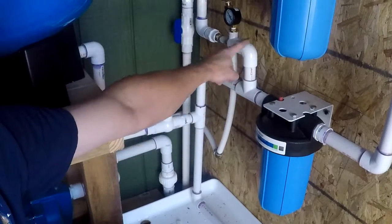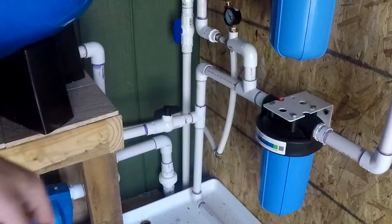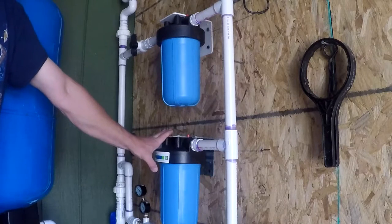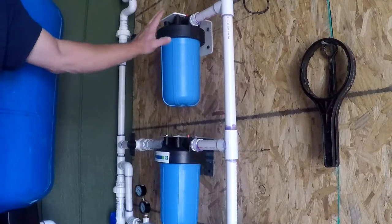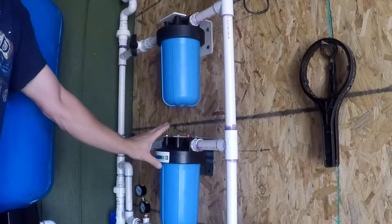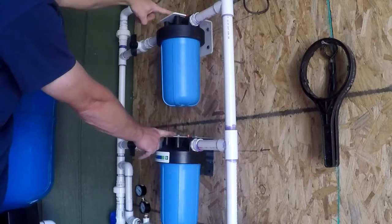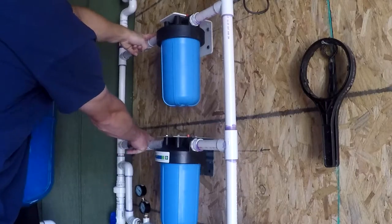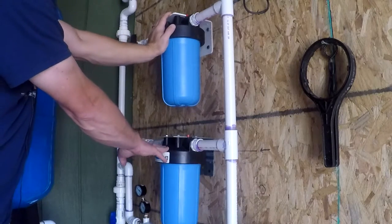Following the water: it goes in the first valve, takes a pressure reading, goes through the pre-filter, then comes up and splits. The final filter used here is what's called a drinking water filter — the Rio 2000 six-candle filter system. It's the same filter used in both housings. Water comes out of the pre-filter and goes into both of these filters simultaneously, is filtered, and comes out at the same time. The Rio filter systems work exceptionally well.